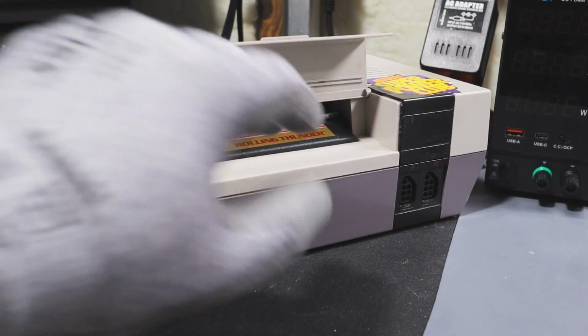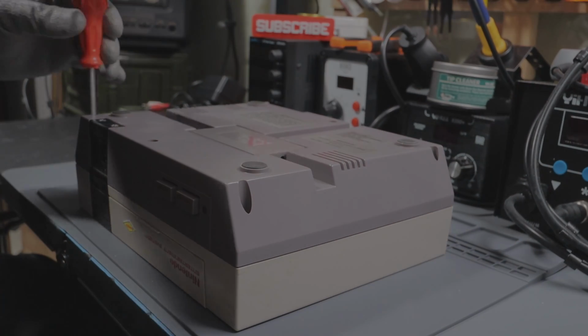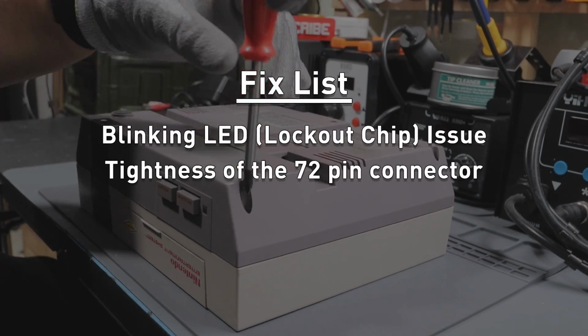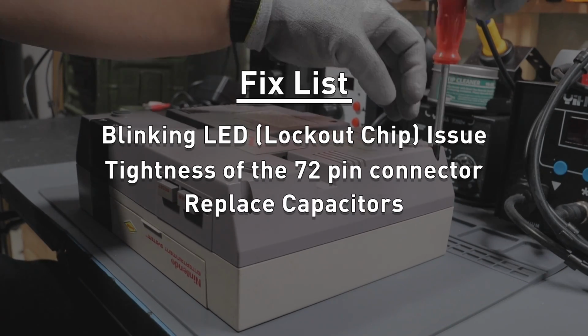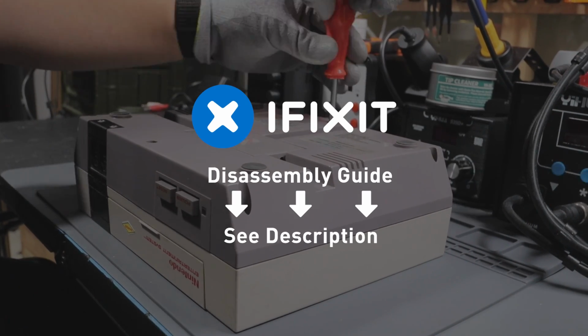Also, it has a problem with the 72-pin connector. I can't pull this game out. To reach my goal of having this be my everyday NES, I have a few things on my fix list that I have to get to, which are the blinking LED/lockout issue, how tight the 72-pin connector is, and replacing all the capacitors, which is going to be the most time consuming. I linked the iFixit disassembly guide in the description just in case you need to disassemble your NES.